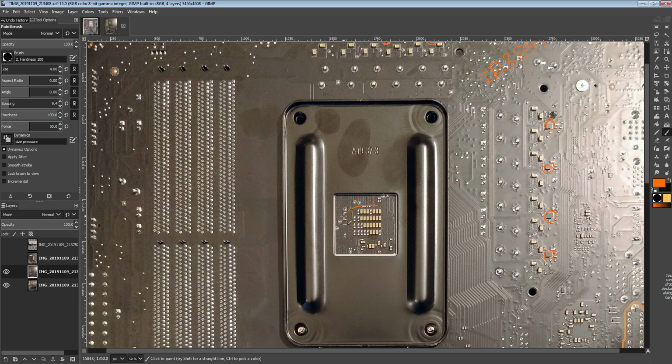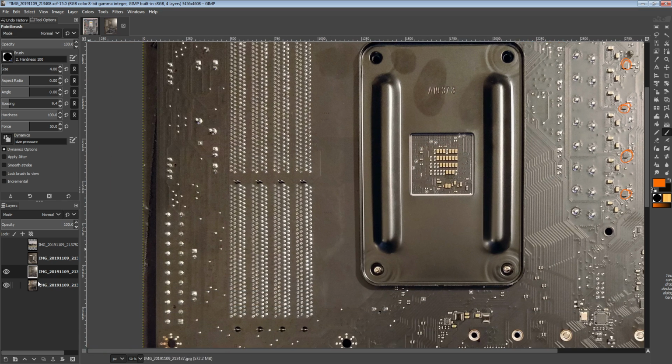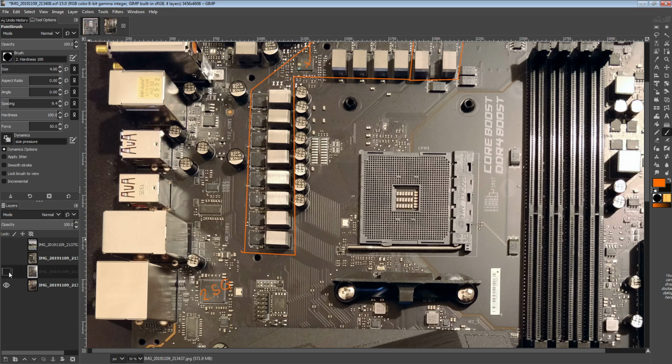Or maybe when MSI was testing it, they found it just makes our overshoot worse by 20 millivolts, and it was like, well, overshoot doesn't affect overclocking, so we don't need those capacitors anyway. Which I totally agree with. If the only thing adding those capacitors back on does is reduce the overshoot, then why even bother? Because it doesn't make the overclocking any better.